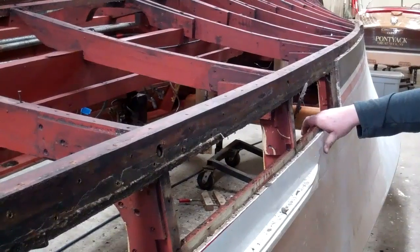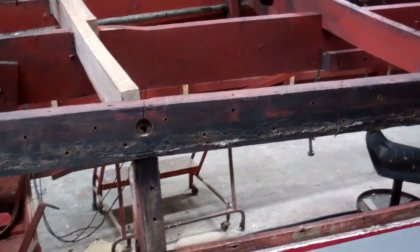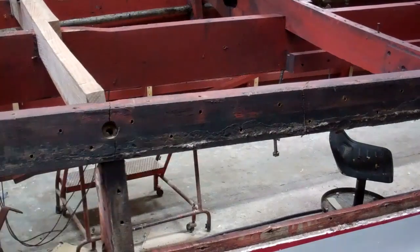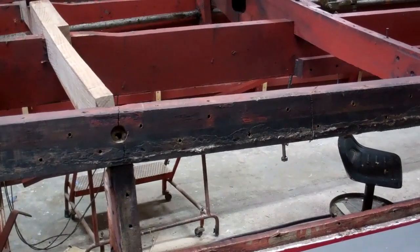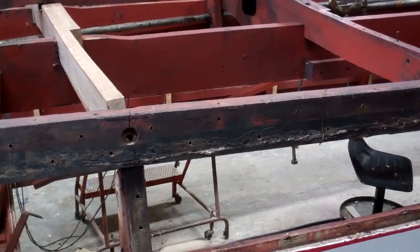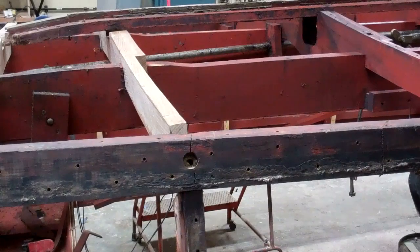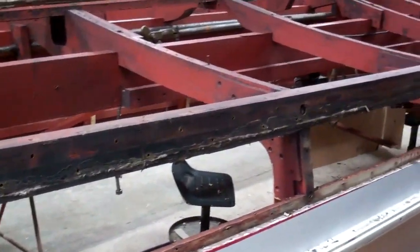this is really the explanation for why, at least at this point, this entire boat will rack and torque, because the chine frame on port has been broken, which means essentially this part of the aft end of the boat is floating. So Joe's going to keep working on getting the framing back together. We'll be replacing this section of chine frame.